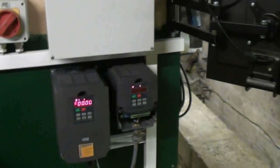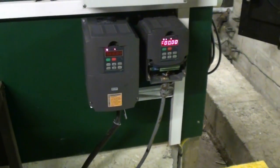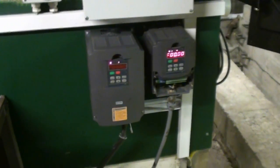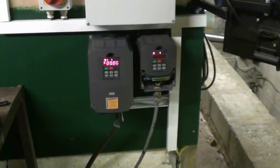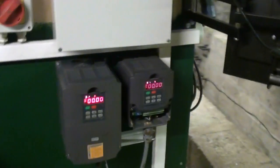I've had a few people asking about these VFDs — what they're for and how they work. How they work is quite technical and to be honest I don't fully understand it myself, although I've got a fairly good idea. But that's fairly irrelevant anyway. Basically the reason we're running these is that here on the farm we've only got single phase electricity — 240 volt single phase here in the UK. We could have three phase installed but it would cost a lot of money and we don't really have much need for it. So for the few three phase applications we use these VFDs.